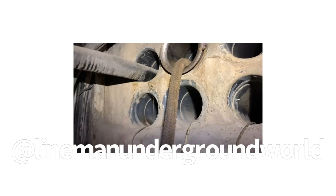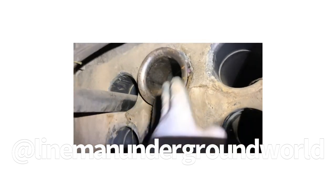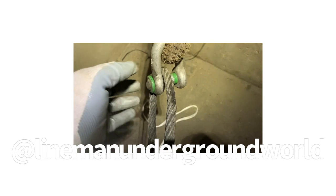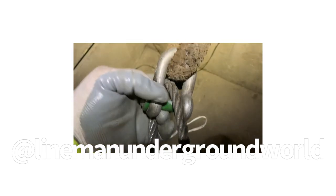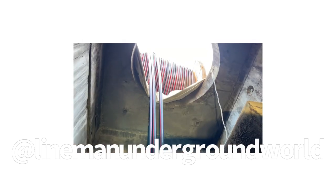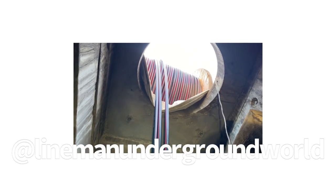Cable as it scrapes by or at a different angle or something like that coming this way. So that's why we put that there. Also, another thing is never turn the clevis the other way because these become like a stopper, okay? So always try to put the round part facing where it's going to be pulling, as you can see right there. All right. I told him to move the dolly back because it's too close to the end, so.